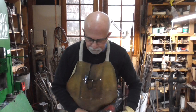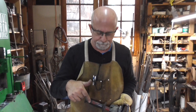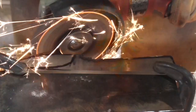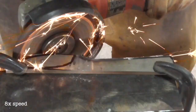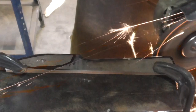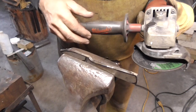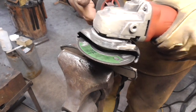Normally I would put this on a vise angled up, but I'm assuming you don't have a vise. So I'm just going to start with the knife down here on its side instead of vertical. Vertical's easier, but it doesn't matter. We're not doing a great deal of pressure to grind the metal here — you want to let the grinding wheel do the grinding, so maybe twice the weight of the grinder. Now I'm going to do this vertically and move the guard so it protects this hand.